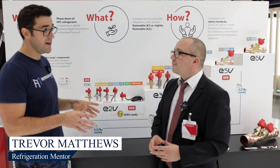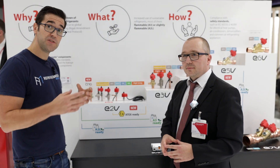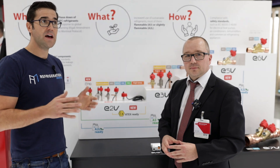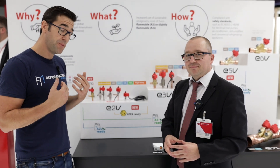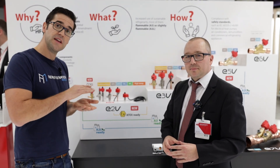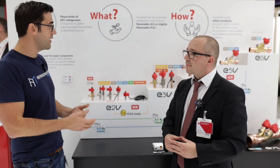All of these are stepper valves. The difference between a stepper valve and a pulse width modulation valve is that pulse width valves open and close repeatedly. You can get them close, but personally they're not as smooth as a stepper valve. With a stepper valve you can fine-tune it so precisely that you get a straight, steady superheat in the evaporator.